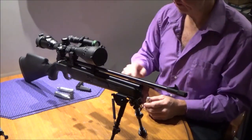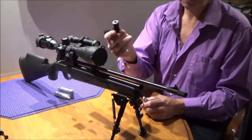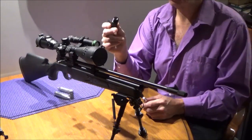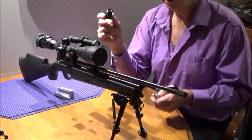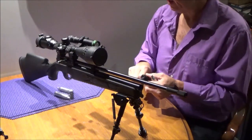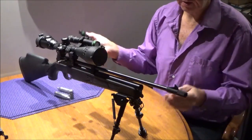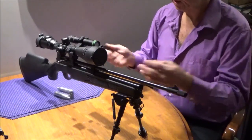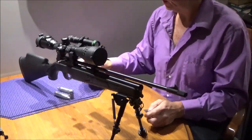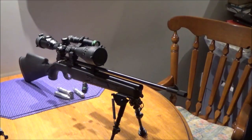Wait about five minutes, shoot off another couple of rounds, then you can remove the cap. You also shouldn't have any expansion in your O-ring. I did upgrade O-rings in my gun — I got these green refrigerant-class O-rings, actually called air conditioning O-rings on Amazon, and they work much better than the stock black O-ring that comes with the gun, although Diana does give you a couple of spares for the cap. Diana should have put the right O-rings in to begin with. As long as I wait that five minutes, I have no problem getting this out, slapping in three more bottles, and going again. Hope you enjoyed the video — catch you on the next one!